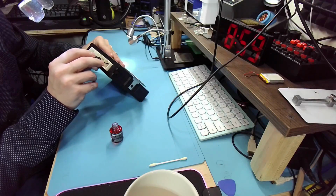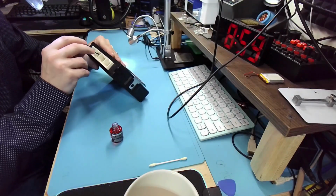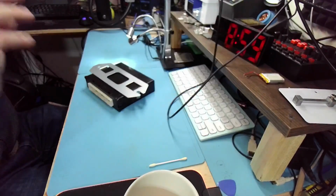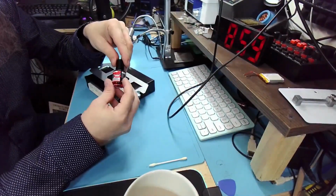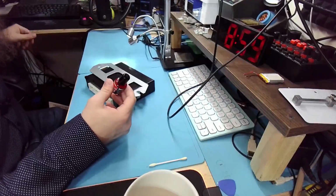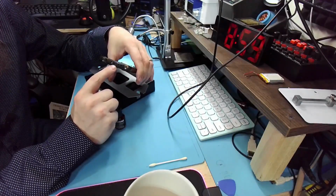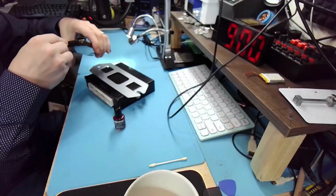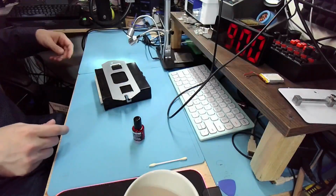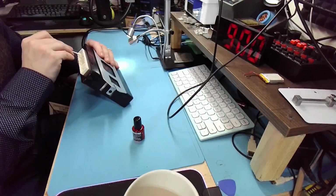But all of those tin ones or zinc ones, they definitely could use it. That's gonna overall improve the connectivity. It's good for not only electrical connections, but data connections as well. Improves the data speed. I found that if you use it on phone connectors, they charge faster. No surprise there, obviously. But sometimes you think, well, it's no longer charging fast, I need to replace the connector. And sometimes it's just the cleaning. The connector is fine, it just needs to be cleaned.